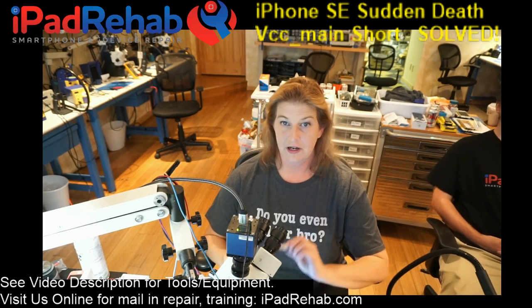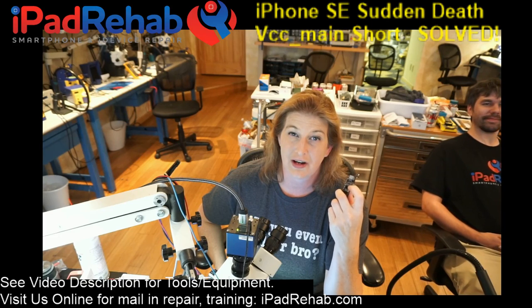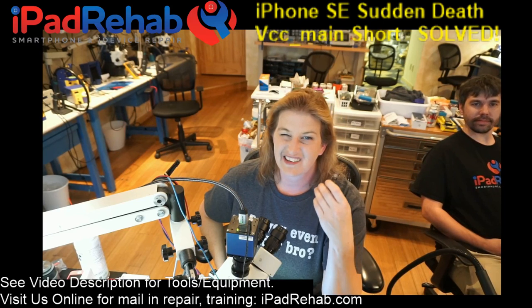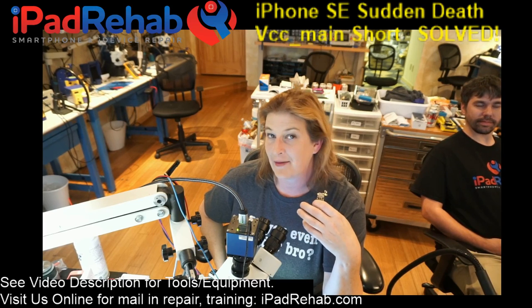Okay, so now we know: iPhone SE sudden death, VCC main short. If you don't see anything wrong, then check on the audio IC and the audio IC caps. Ask for history and see if it died after being on a car charger, or died on a nightstand. That's going to point you towards different things like TriStar and Tigris. If it's, hey, I was playing some loud music at a stadium, that'll point to audio IC. And it's not just audio IC, apparently it's audio IC caps as well.